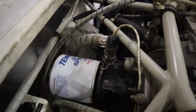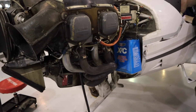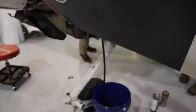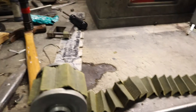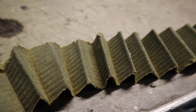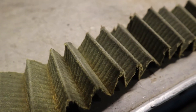The main thing we do at a 50-hour service interval is change the oil filter and inspect it to make sure that there are no contaminants in the system. A thorough inspection of an oil filter is a great way to tell the health of an engine. Every filter after it's cut should have no metal contaminants and be clean and free of any blockages, like this one is here.